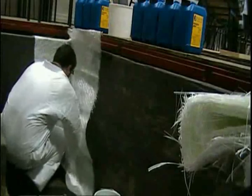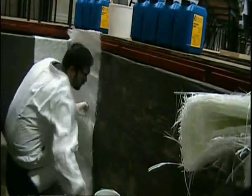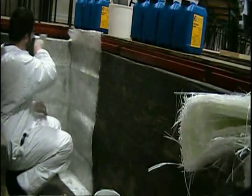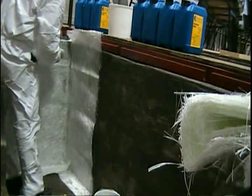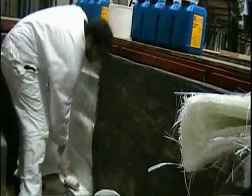We tailor the fibreglass in place by tearing and not cutting. This will create a frayed edge to the fibreglass which will blend in a lot better than a neat cut. Apply a small amount of resin to the top edge of the fibreglass. This will help hold it in place while you cut off any excess fibreglass matting.